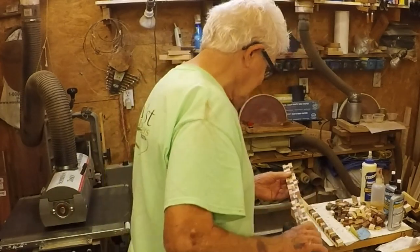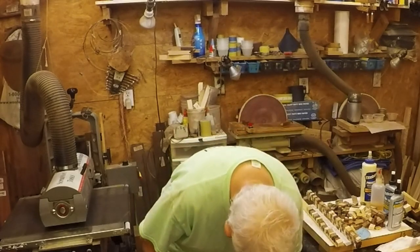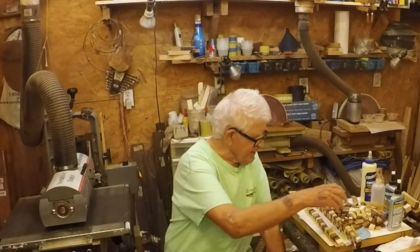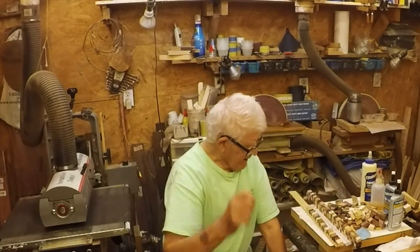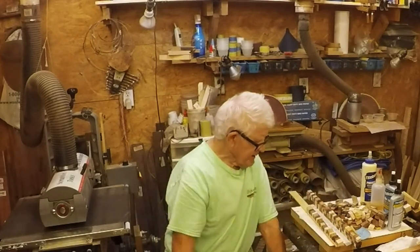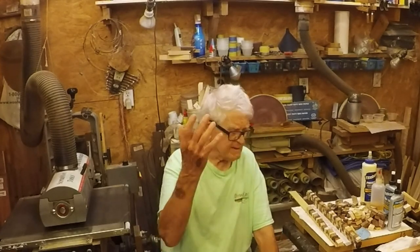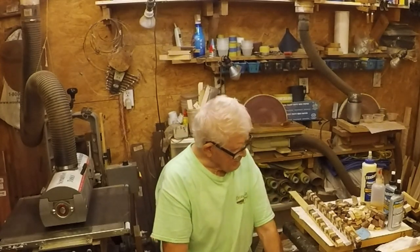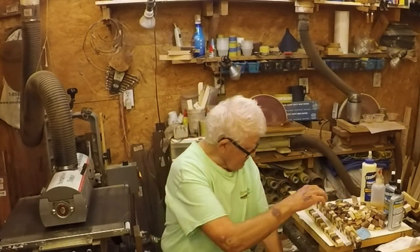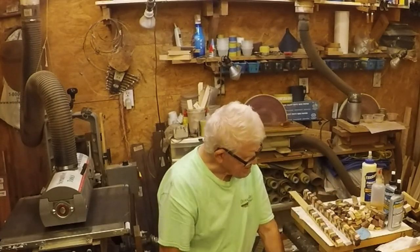Of course, it's time consuming. It makes great turning when you finish, but it is time consuming. What I did, I took all the woods and cut them up at an angle. I use them 22 degrees for this. Now, you can cut them at any angle you want. These are almost 1/2 inch thick, so it makes this almost 1 3/4 inches when finished, which is pretty tall, really.